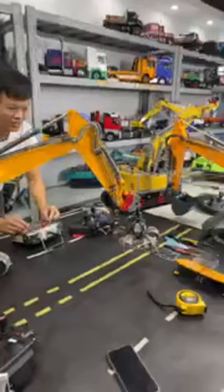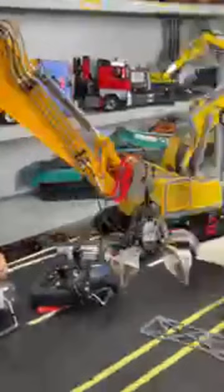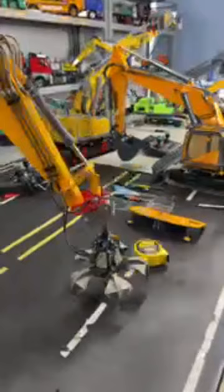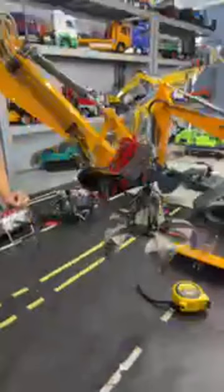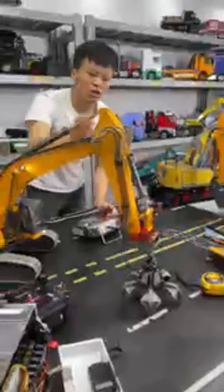We can move the arm to see how this one is moving. This hydraulic setup is a little bit different. Maybe some experienced drivers will know, when you drop the big arm down with one pump, it is no problem. But because of its own weight, it's dropping down, no pressure needed, so oil will go inside directly.